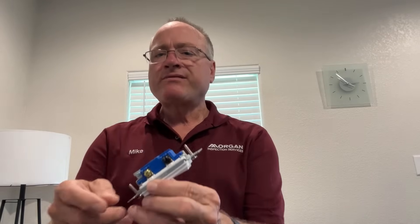These three-way switches are a little more complicated than your standard switch. They've got an extra screw — it's black, it's called the common. And I'm going to explain exactly what that common screw is for and what you connect to it. Through these animations, I think it'll make it very clear to you how to wire your three-way switch, and you'll be able to do this project in your own home without any difficulty. So let's get started.